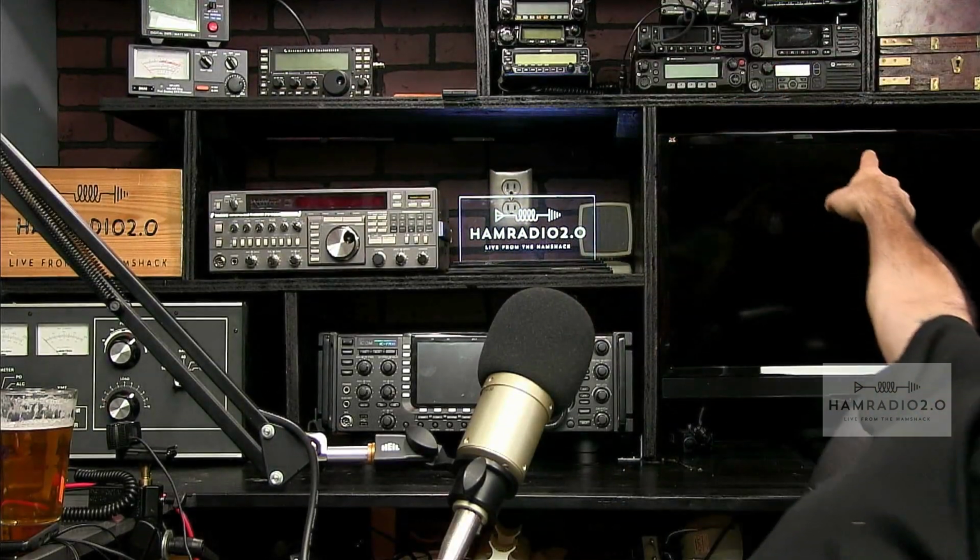If your radio is, say, a Motorola radio, a lot of the 5550, that radio right there on the right, can you see that? Far right, second one from the bottom. It'll transmit GPS. You can put a GPS antenna on it, and you can turn the GPS on in the CPS, and Motorola systems will transmit GPS. Most C-Bridge owners have it turned off, but you don't have to.